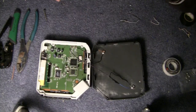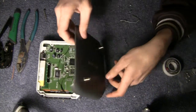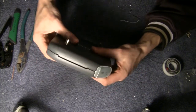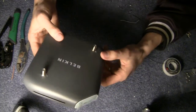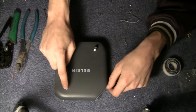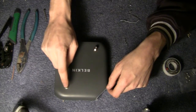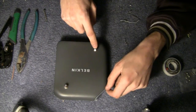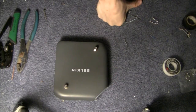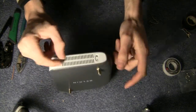With your wires reinforced so they won't break off, reassemble it. Make sure your wires are in the right place going to the right connections so it'll just drop back together. Keep in mind that the upper antenna in the DD-WRT interface will be right and this one will be left — at least that's my finding with the routers I've done this to.